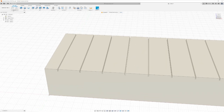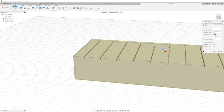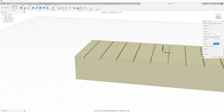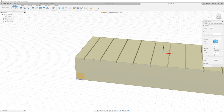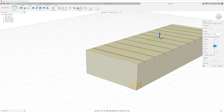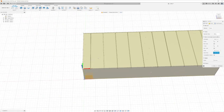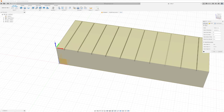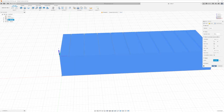Let's make a new setup. We'll need to make sure we don't add any top offset on the stock, and let's get the side offset to zero as well. Let's adjust our origin point — make sure our body is selected, set the X and Y axes appropriately. When we're standing in front of the machine we'll be looking at this view. Let's double check we don't have offsets — the width is six inches and two and a quarter depth. That looks good.